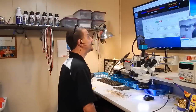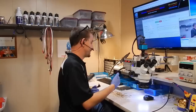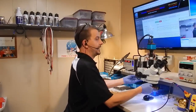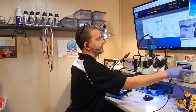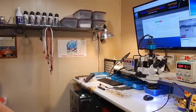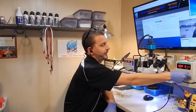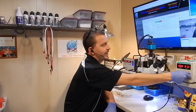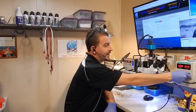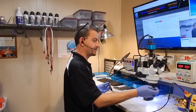The first thing I'm going to do is show you what brought me to this conclusion and what I did to decide that this was shorted. This is a phone that's had the battery hooked up to it all the way here. I've set my power supply to battery voltage — about 4 volts, which is normally where it stays. I'm going to drop the amperage all the way to zero, which on this cheap supply also drops the voltage to zero, so you can't tell where your voltage is when the amperage is turned down.